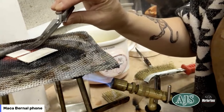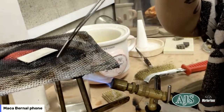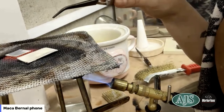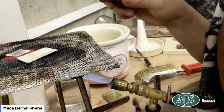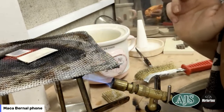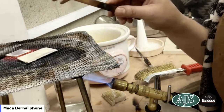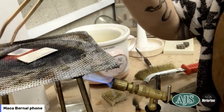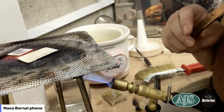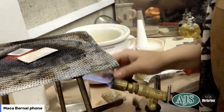Place it back into our setup — the 'chilean barbecue asado' as we call it. You can see the oxidization on the other piece still in the fire — that's what you want: a dark gray. Once it's spent three to five minutes at 650 degrees, we are ready to quench one more time. For both the small and large pieces, this will be the last round, and then we go straight to reticulation.